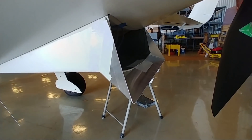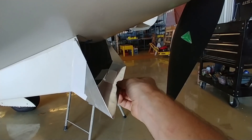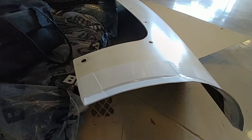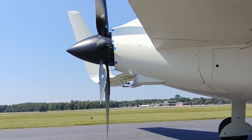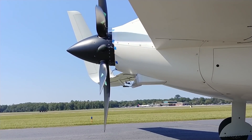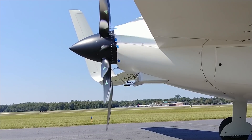The next little experiment was creating a lip on the cowling to force the air down away from the outlet and see if that makes a difference. I made a little template for these small pieces and taped them onto the trailing edge of the cowling on the upper surface, because the air was sort of following the cowling down and potentially not creating enough low pressure there. This is a static run on the ramp — just ran it up to full power to see how the tufts were looking. I don't think the bottom one is making much of a difference, but the upper one looks like the tufts are being deflected more directly aft instead of following the downward slope of the cowling.